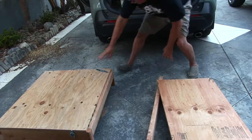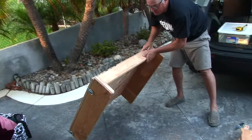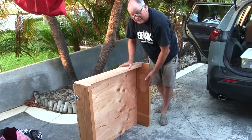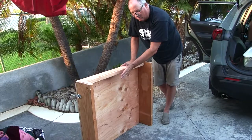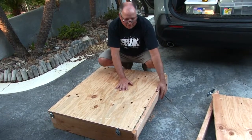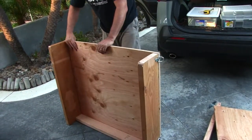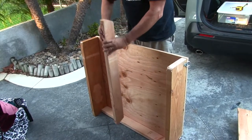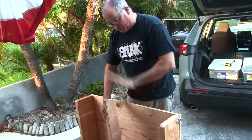It's awesome. This is the base structure, panel number one, and it has two 2x8s which are like skates — this is what we're going to slide in and out on. We didn't put a 2x8 here because it would cause problems with sliding and also it would be heavier and could fold over. But this 2x4 keeps it stable horizontally. This is the end that the bins slide in on, and we store this right here. The chamfer keeps it from hitting the back of the seat as well as from hitting the hatch when it comes down.